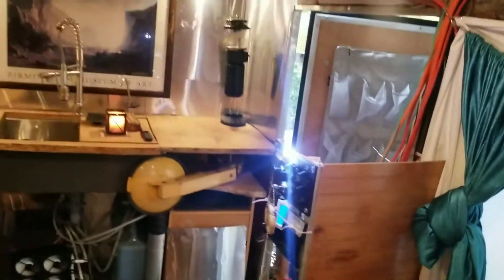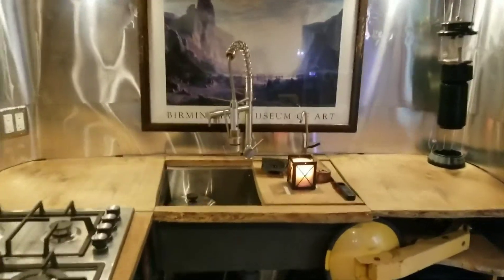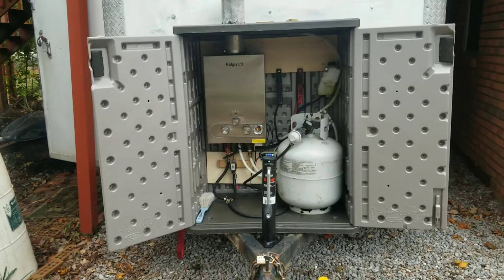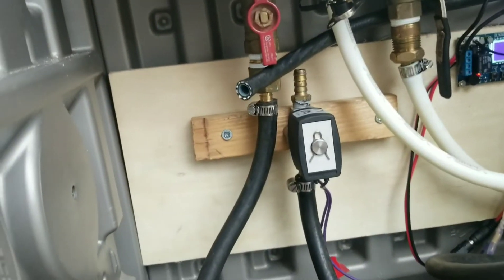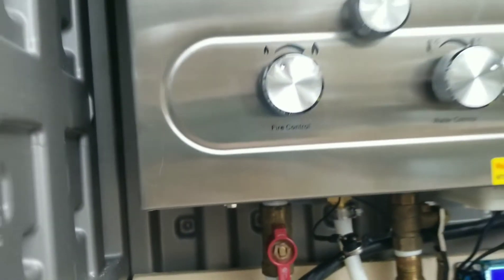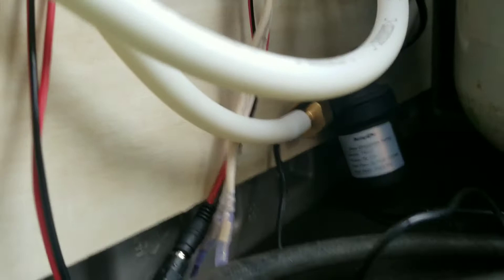Let's take a look outside at the more technical parts of the system. This is my utility box I just put on the hitch. You can see there the hot water heater on the left, propane tank, the gas valves, solenoid for the stove inside, and a valve for the water heater and the input and output water pipes there. There's a hot water pump — it's a very robust pump that's made for very high temperature water like for solar heating systems.